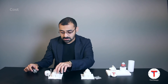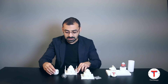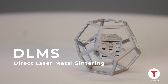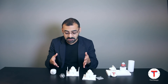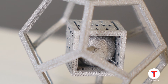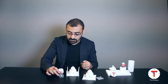Now let's talk about this part made out of metal. This metal printing process uses the same technology as SLS — it is a powder bed technology referred to as DMLS. We expect to see many similar advantages and disadvantages to SLS. For example, the surfaces are quite rough. This particular part is made out of aluminum alloy, and the surfaces are very rough.